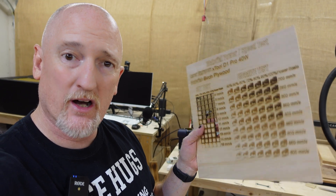I dig it — it's cool that we've gotten to the point in innovation where we can run 13 millimeters per second to cut through 3 millimeter ply. They're not going to use this to cut a 2x4 in real life — that's just to see if it'll do it. But for normal laser operation, it's pretty cool that we've got almost a three times increase in speed. If this video has piqued your interest in the 20 watt, watch that video right here.